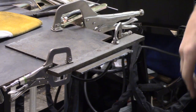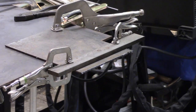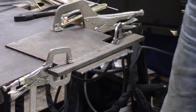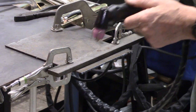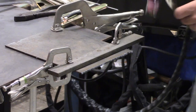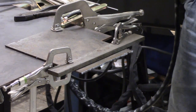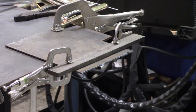This is a learning process. I haven't got a shade five face protector but this one will do just for eye protection. I've just moved the fence back a bit. I've realized that the air is like a post-purge, which I guess is cooling as well. Because it's only eighth plate, I've cut the current down to 30 instead of 50. From what I've learned from others, it seems a drag cut is probably the easiest and gives better flow. I've dropped my air pressure down to about 50 — they say 60 to 65, but that's okay for the heavy stuff. I'm just going to switch on and try again. It's a learning process!